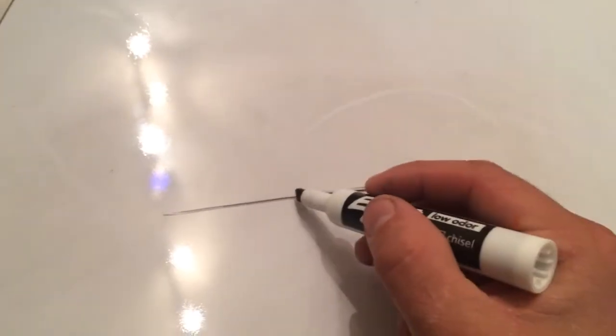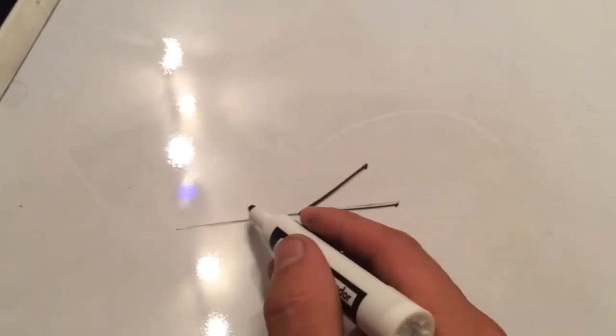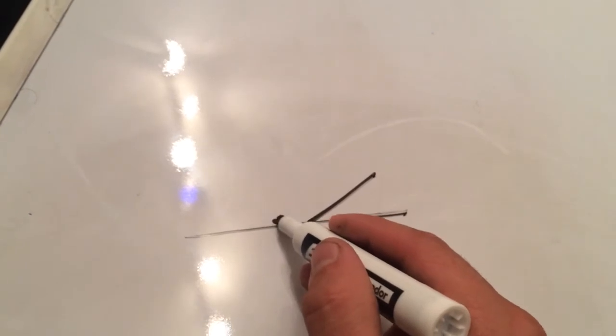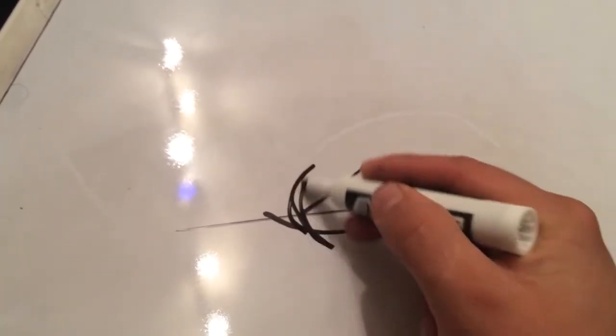So, sharpening these brings me to my sandpaper method with a foam backer. If you were to try to use a method like this on something with a V-ground edge, you would do this. You got your foam backer, and then you'd be pressing your V-ground edge onto that foam backer. Now the problem with that is that foam backer is going to want to give, and that is going to round out your V-ground edge, and it'll cause a loss of sharpness, which is a problem. We want to keep our knife sharp.